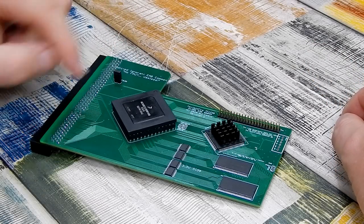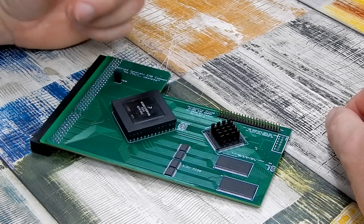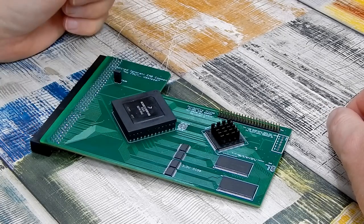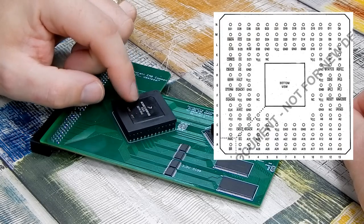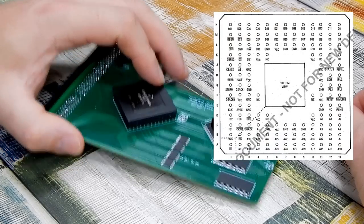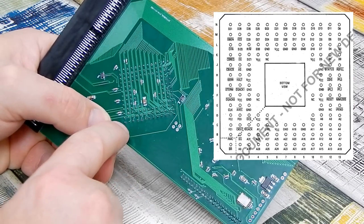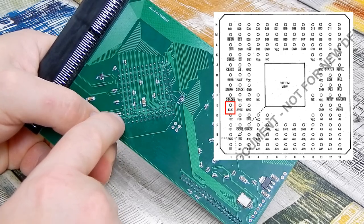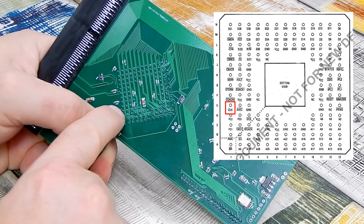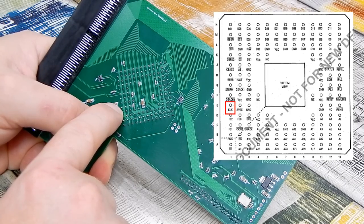Well, it doesn't make its way over to the edge connector. The furthest it gets towards our FPU is going to be this, and if we pull up the pinout for an 030, well, that's looking at it from the bottom, so that's that sort of orientation there, with pin 1 now at that position, and it's the 5th pin up on this side, so 1, 2, 3, 4, 5, it's that pin there that we need to make the wire off onto.